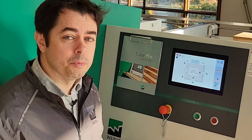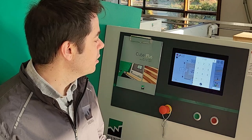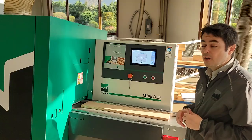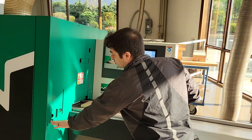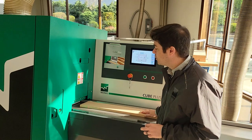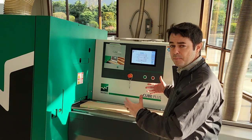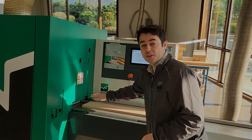When you turn the mobile spindle feature on, you can also define a value by pressing this button here. This value is the amount of material you want the spindle to take off from your workpiece after it's measured its width. When working with the mobile spindle, it's important to note that the photo eye on the side of the machine measures the width of your workpiece at the front when you slide it up to the gate. That means if your workpiece has a large bow or is tapered, it's only going to measure the width at the front.